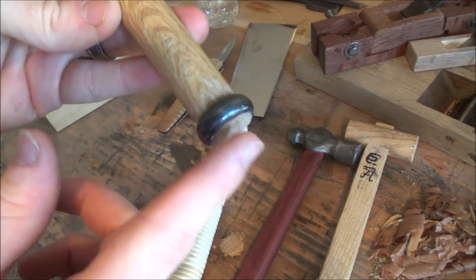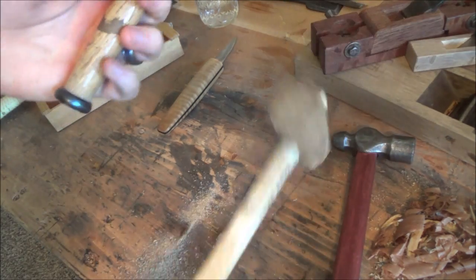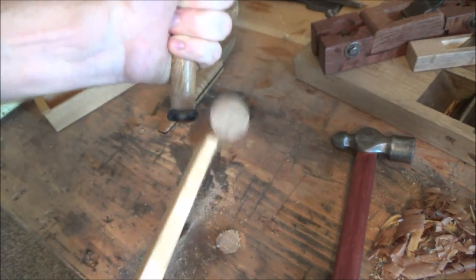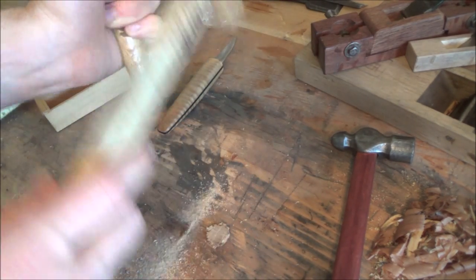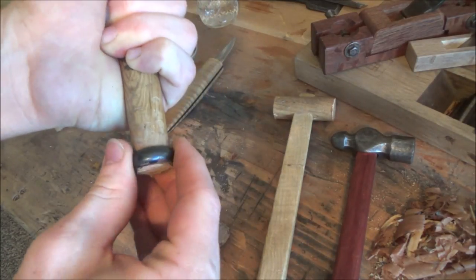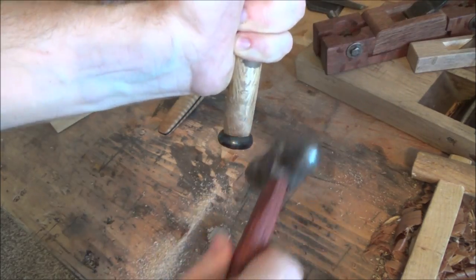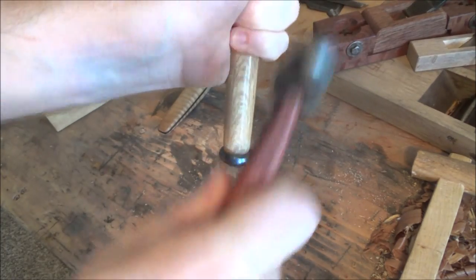Now we can remove this — I've gotten rid of that mushroom there. The way I do this is two-fold. If it's on there extremely tight, you may not be able to use a wooden hammer, but to avoid scarring it up and marring it up, I usually try to knock it off with a wood hammer first. Normally you just want to have it in a place so that when it pops off it's not going to go smacking into someone's foot or go flying into someone's eye. These things can come off with a vengeance, so be forewarned of that. So you're just going to take some gentle taps. Be very careful not to hit your hand and work around the edge of the chisel.